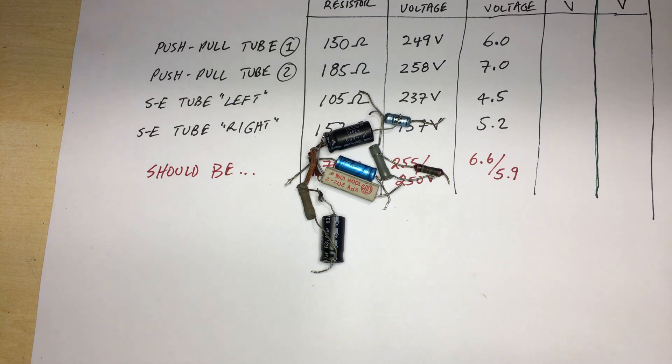Following on from the previous video, we just got to the stage where we tested the radio. The conclusion was a sort of half-hearted positive: FM is working, although very weak, but it's working — which is good news. The AM is very, very weak. As someone suggested, maybe the previous repairer messed around with the IF transformers as well, but we'll see that when we come to it.